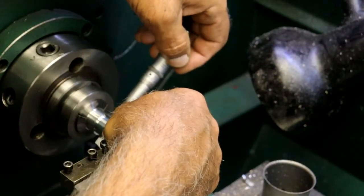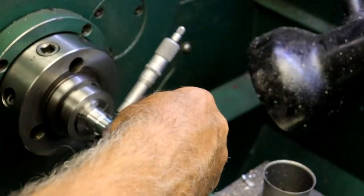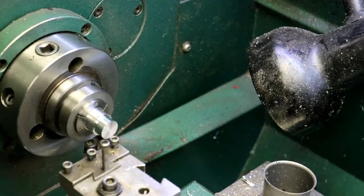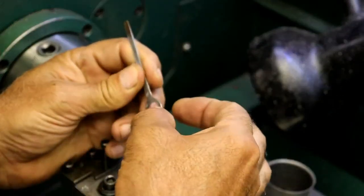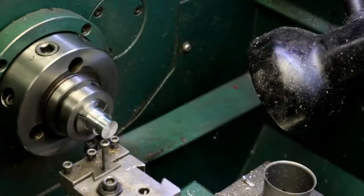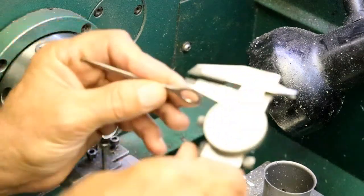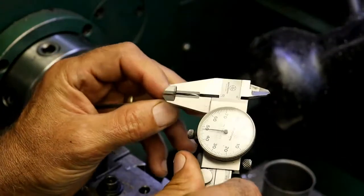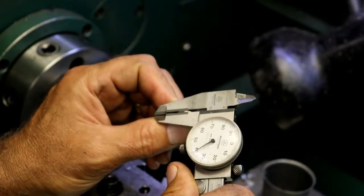Throwing the chips in my chip barrel — take them back and recycle them. We're at 35 now, approximately 34. That's plenty good. Now we need to turn a slip fit to this ID, and we only want to go the thickness of it plus maybe 5 or 10 thou. The thickness is 30, so we'll probably go 40 thou.